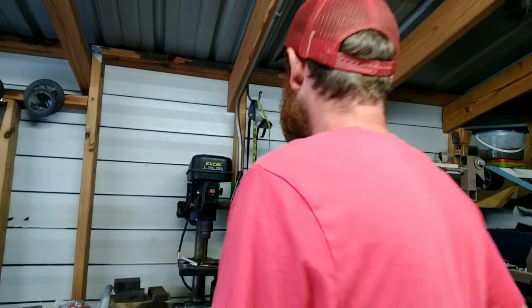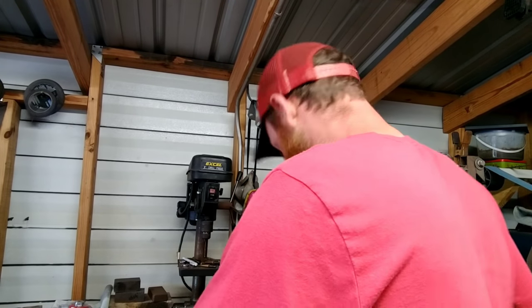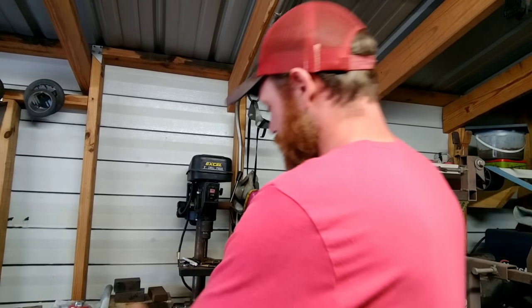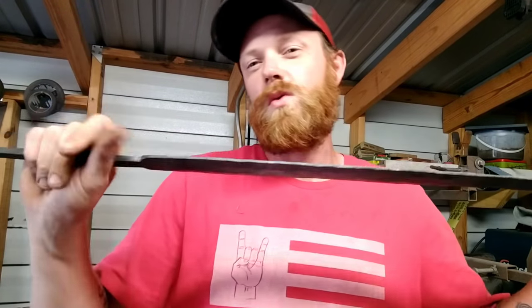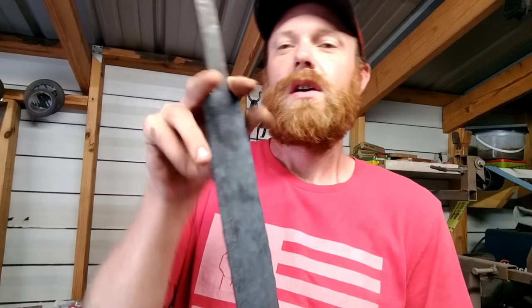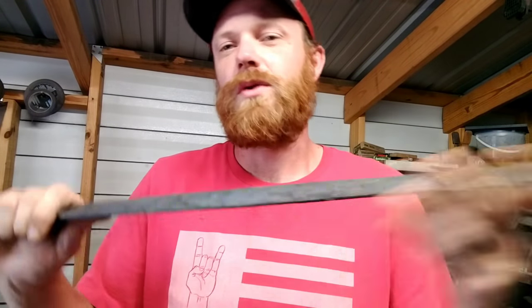The blade, as it spans right now, is 23 inches long. So we're going to be right at about 22 inches maybe. Cutting our shoulders for the tang to the point, going over our grinder — we're going to lose another inch here, squaring that up and bringing it to the point. So we've got about 22 inches of blade there.